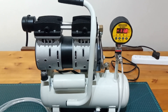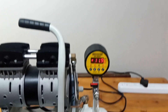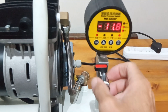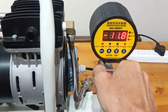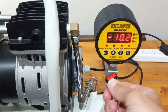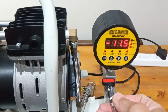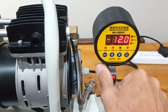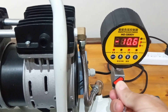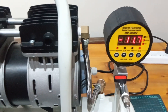And the addition of having a tank provides a bit of vacuum reservoir, which doesn't come on a standard vacuum pump. The ability to control the electronic controller can be set to any level of vacuum with a dead zone — I typically set it to around 12 PSI with a half PSI dead zone, so it comes back on at 11 and a half PSI vacuum. That's just what we're seeing there.